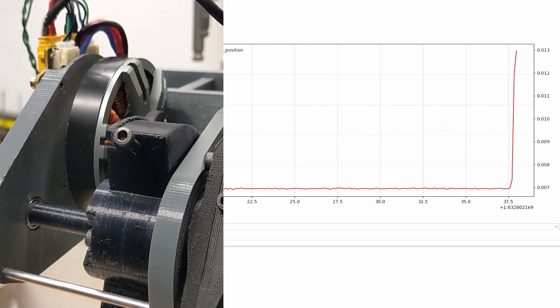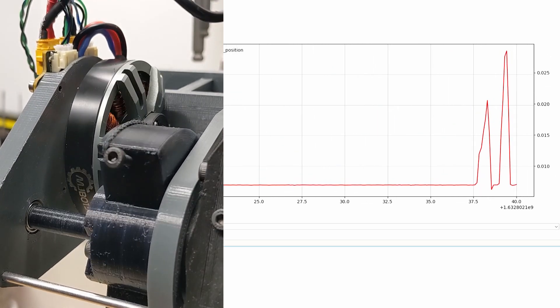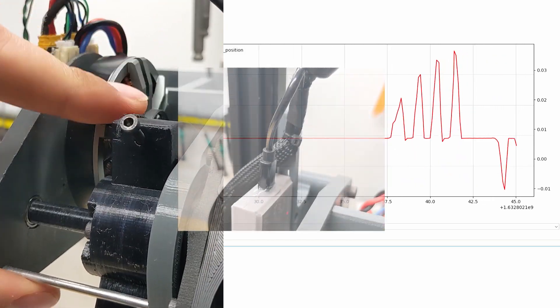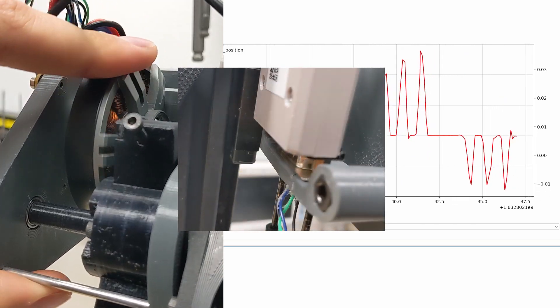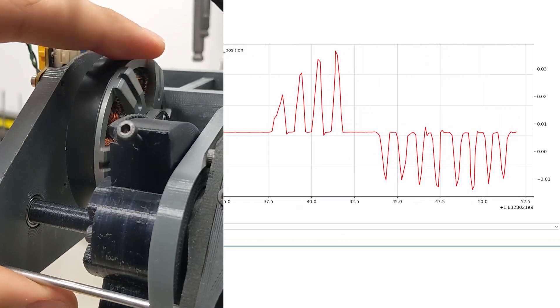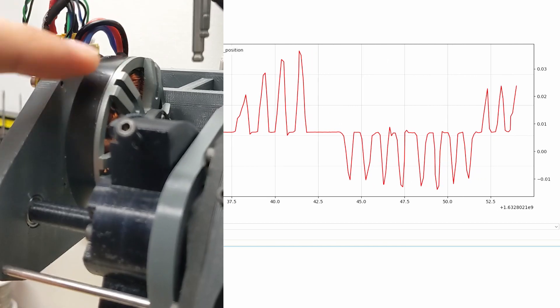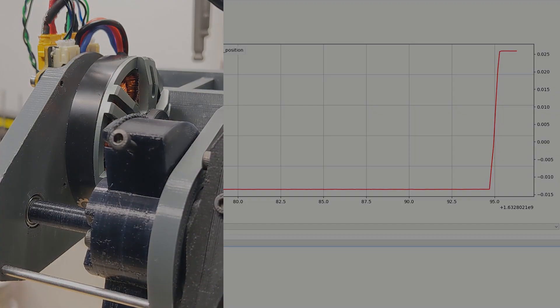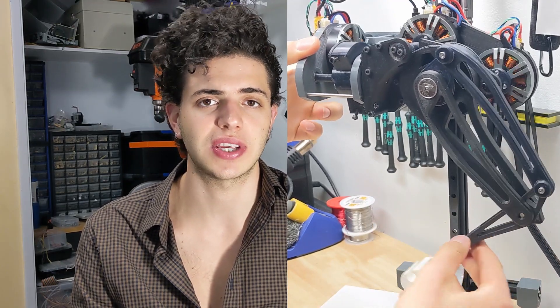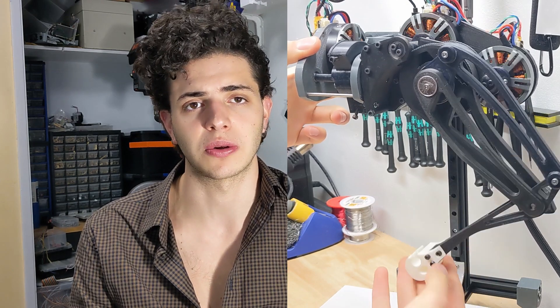Here I'm just using a program for debugging and configuring the motor drivers called TView. It runs in Python on a host computer and interfaces with the controllers via a USB CAN bus converter. It allows us to send simple commands to individual controllers over the CAN bus line to do things like move to certain positions with a specified velocity and feed forward torque. If I provide power to all of the motor drivers and place them in positional control mode, we can see that the leg is able to hold itself in position and comply with external forces, depending on how much current it draws and proportionally the holding torque I allow the PID controllers to use.